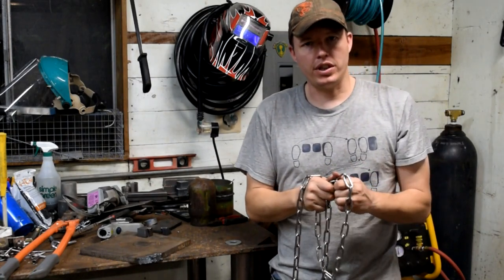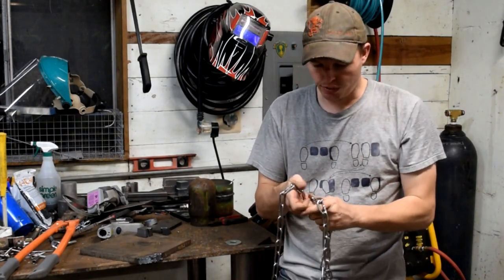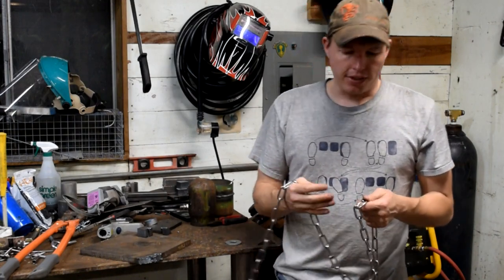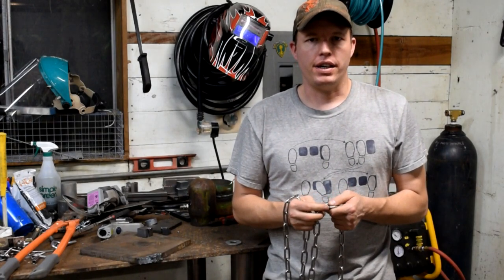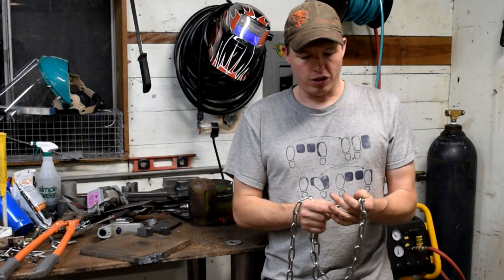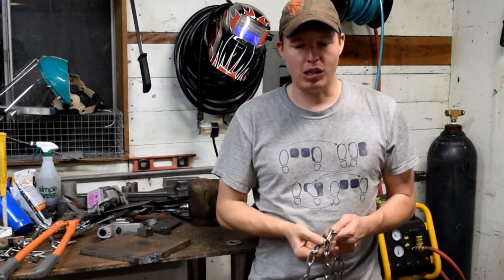Because it's stainless steel, I don't expect it to rot or degrade — it might because it's going to be in contact with steel. There's something called galvanic corrosion that occurs when you have two dissimilar metals together. But without looking at the table, I would assume stainless steel and steel are close enough in properties that they're not going to have what they call a voltage potential. If you want to learn more about galvanic corrosion, leave a question in the comment section below and maybe I'll shoot a video about it.